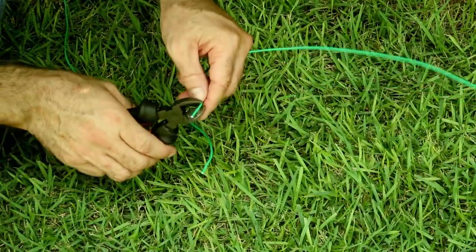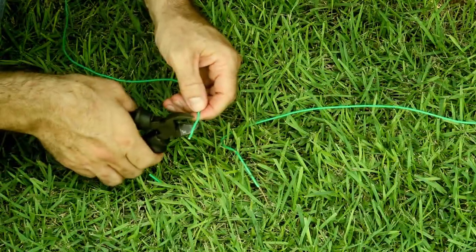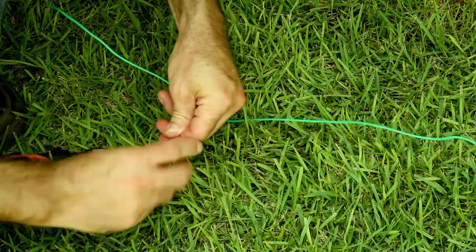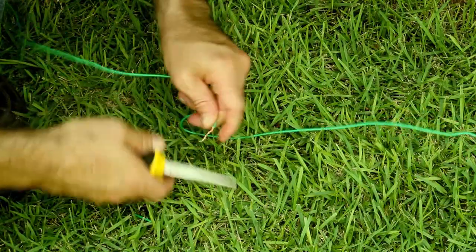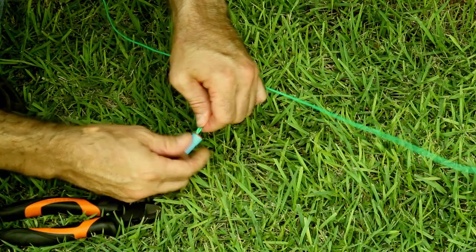When additional wire is required to complete the wire setup, use the connectors provided with the product. Strip the wire ends and twist them together into the silicone-filled wire nuts. Make sure they are tightly secured.